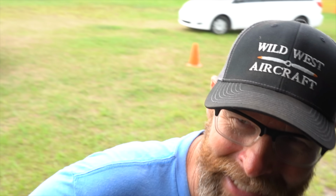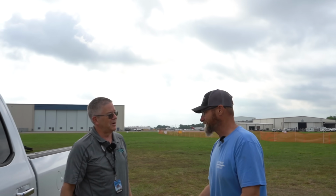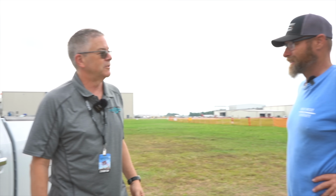Sarah, Sensenich is here. Come check it out. Hello. Hey, how are you? All right, thanks for coming. We really appreciate everything. So I hear you made us a custom prop. Yeah, last night we had one of our engineers cam and cut a special hub. We took a standard airboat blade that is used for static thrust, which is what you guys need. Awesome. And we cut the hubs and got some race blocks to lighten it up and put some lightning holes in the hub, and we're ready to go.